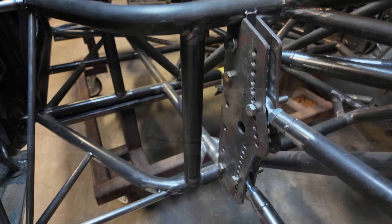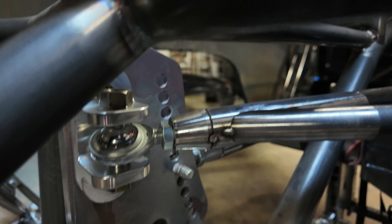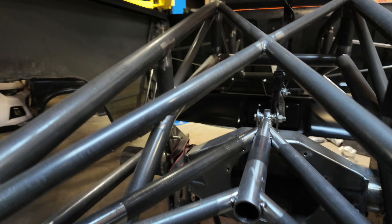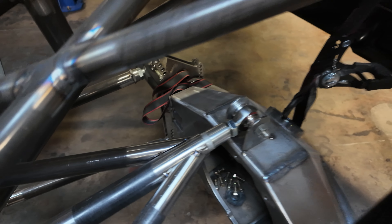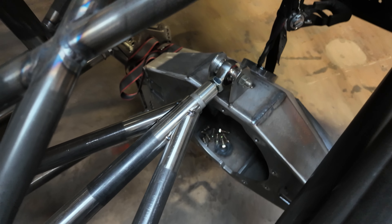Out in the shop: here's the chassis-side bracket installed. There's that clevis — and you can see how that force vector rolls right straight through there. There's the housing wishbone. Wishbone always on the top — because why would you want to battle the wishbone to take the gear case out? There are some tabs; it gets a little doubler plate on the back side. You can see how awesome this stuff looks before it's welded — that's how you get a nice result. Scotch-Brite and a perfect tube notch.